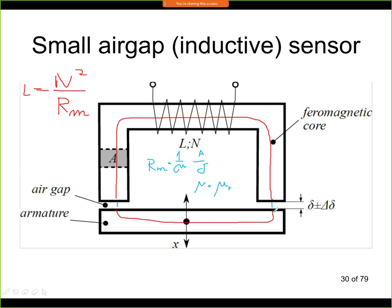The relative permeability of air, so here in this air gap, is very close to 1. In fact, by definition, vacuum has 1 exactly. For air, it's very close to vacuum. It's 1 and then a few zeros, and then just some number at the end. So we can safely say that it's 1 for the air as well. On the other hand, the permeability of iron, so this part shown in red in the circuit, is very high, and it can be more than 1000. So there is a significant difference between the permeability of air and of the iron.